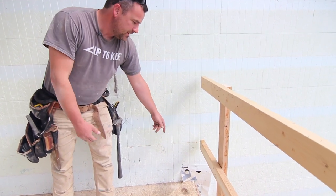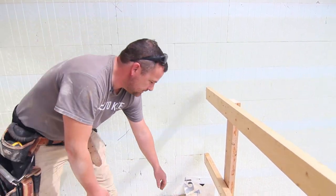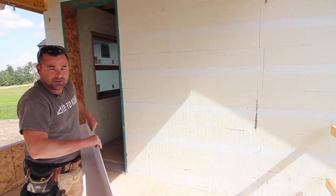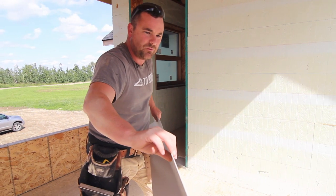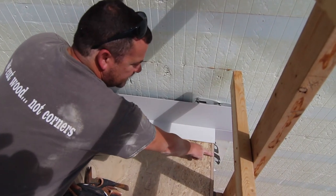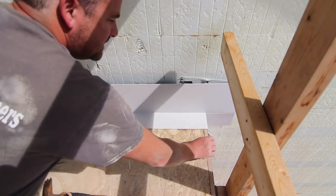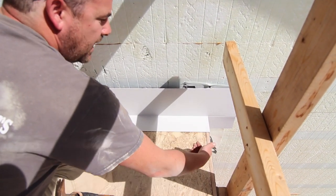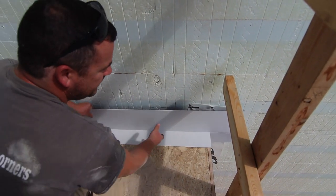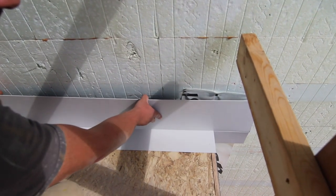I want to get the flashing on. We did some detail work — we did our building paper with some peel and stick on top just to protect the inside corner. I pre-cut this piece. It has the hem at the top — I like doing that so it's a little more rigid and doesn't buckle as easily. This piece here is 5/8 plywood, and later they'll put a drip cap that goes down 2 inches. This plywood is only 7/8 tall, so they can set their drip cap to that edge, and later when we do our siding we can tuck up under the drip cap. My building paper and peel and stick are behind this — I'm just trying to think about all my watershed.